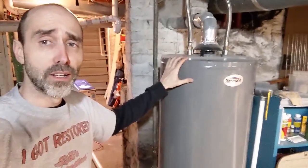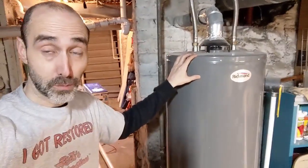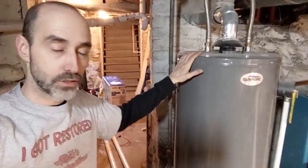I've had this one about three years, it's still fully working — works great — but the reason I'm replacing it is because of a remodel I did in the upstairs bathroom. I put in a new jetted tub and it's got three-quarter inch piping, and the faucet is a full three-quarter inch valve faucet. It can do probably about seven gallons per minute. When you open that hot water valve on that tub upstairs, it'll drain this thing real quick. With four people in our house and a washer and dryer, this thing barely keeps up, so we're going to go with a tankless unit.